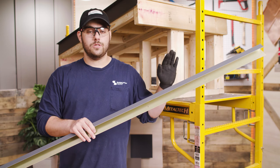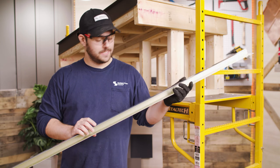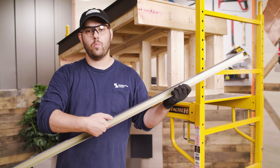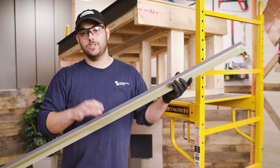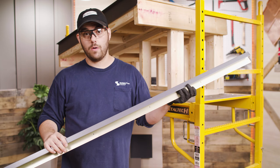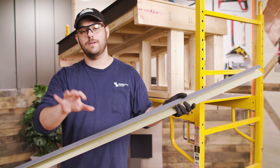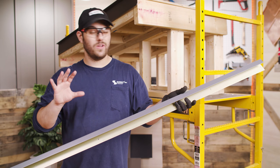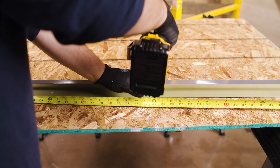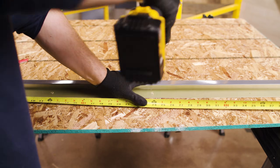After you install your nailers to make sure that you have something for your trim to hook onto, I've got this custom piece of J-channel here. This is a 1-inch gap between the cover and the nailing flange to match the rib height of our flush wall panel. In this video, I'm not going to talk a lot about terminations and details when it comes to the soffit install — I'm really going to show how to install the panels. For now, I'm going to prep this J-channel, take some measurements, and you'll kind of see how it goes together in a second.